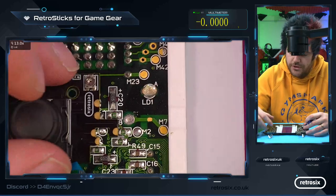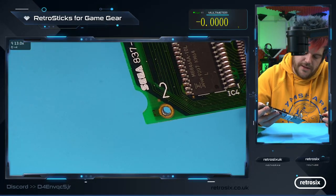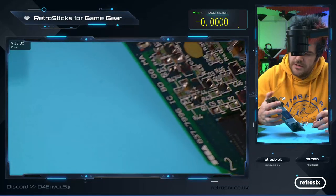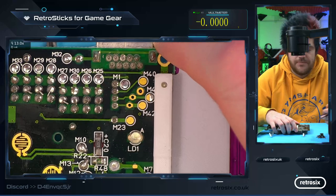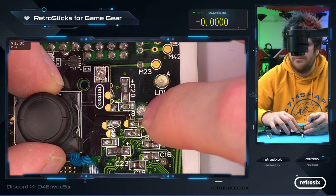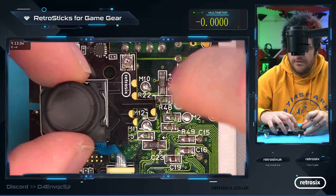There are 2 versions of the 2-chip. This one is the American, I believe, correct me if I'm wrong there. And then there's the Japanese version. And one of them has none of the pads up here. Hence why we go to the R48 resistor so that it fits all versions. But same thing, plonk them on, connect these four pads to ground on, for example, this one.